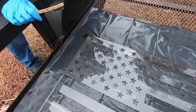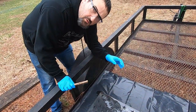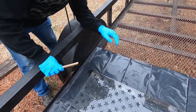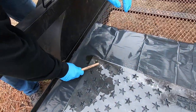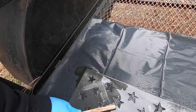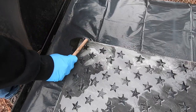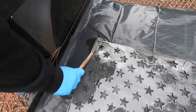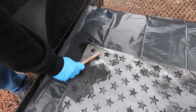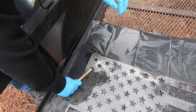We've been letting that acid soak for a little bit. It stinks. We're outside and obviously well-protected with gloves because this stuff is pretty nasty. Check that out — that mill scale just wipes right off. The cool thing is the surface is etched after doing this because of the acid, so any chemical treatments or anything you want to do on it, it takes them really easily.